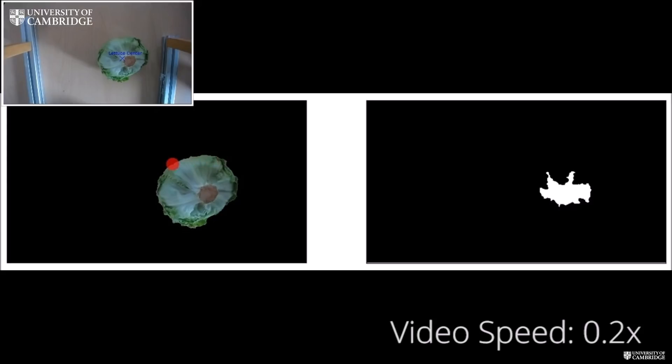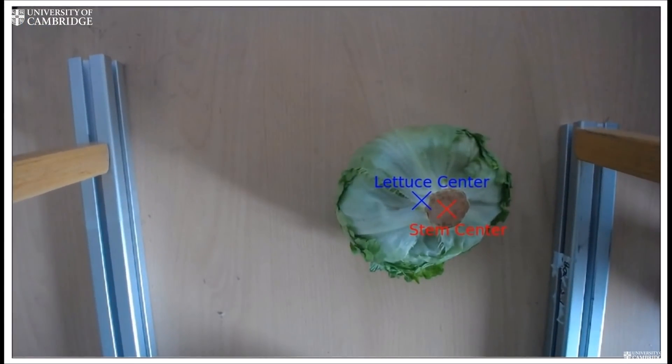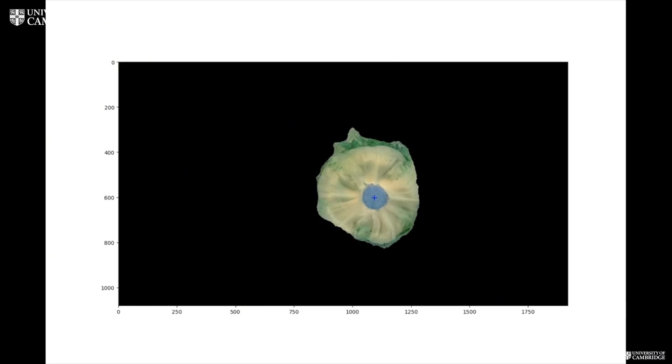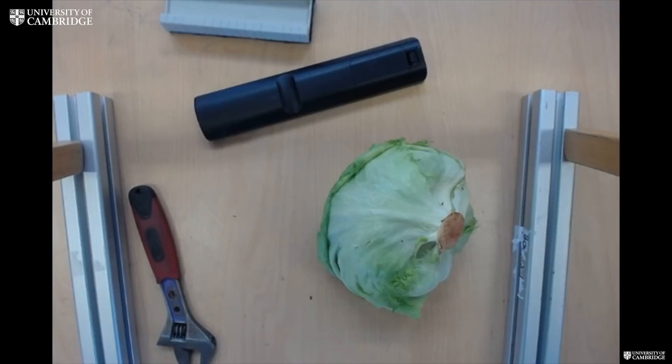The lettuce can be in any position and any orientation, so if you want to locate a leaf and tear it, you first need to know where the lettuce is and in what position it is. There are no clear features which tell you the orientation of a lettuce, and we argue the best way of doing that is by using the stem. Once you find the stem and have the location of the lettuce within the field, you'll have a vector passing from the stem to the center point of the lettuce. If you assume a height and know the position of the camera, you'll have a 3D vector telling you which orientation the lettuce is in.